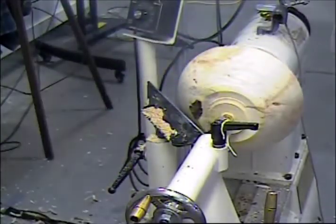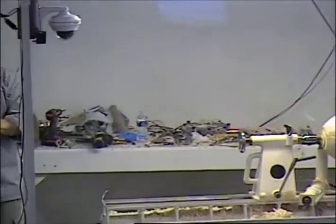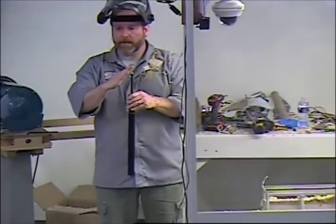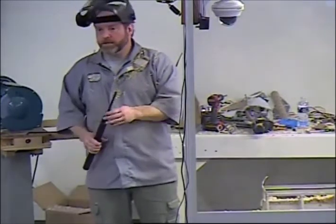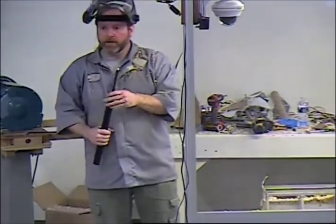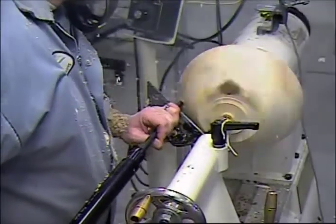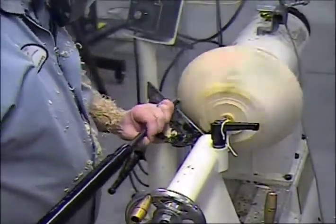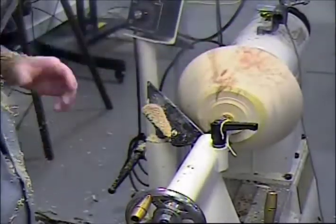Little bit of torn grain, so we're going to go ahead and resharpen. No, once I've already created the 40-40 grind, you don't have to go back and reestablish this. Maybe after 20 or 30 resharpens, you might need to reestablish it, but no, it should be good now. So we're good with that.